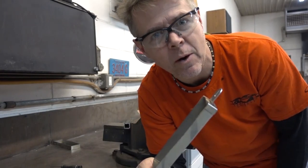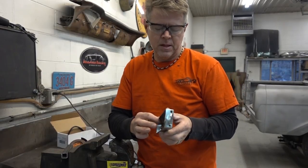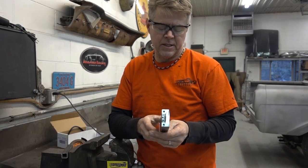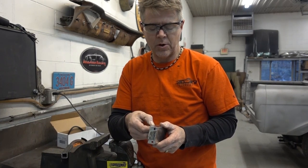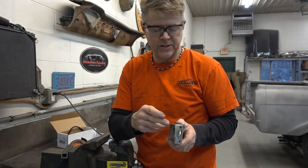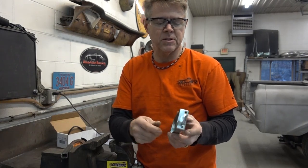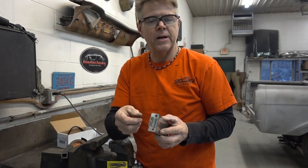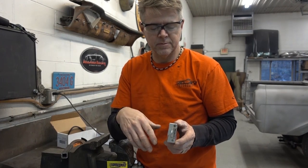Anyway, one step done, twenty to go. We just cut this off and before I put it in I noticed — on this side where I scribed it — I'm not quite perfect on that. I want this straight because I'm putting it against a straight piece of metal, so I'm just going to clean this up, grind it right down to the line. It will be straight and perfect.